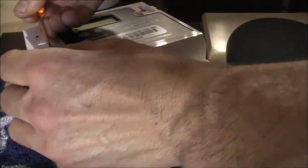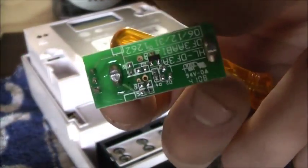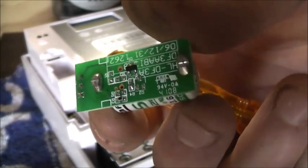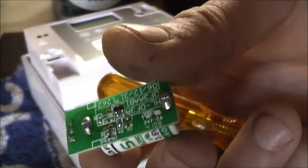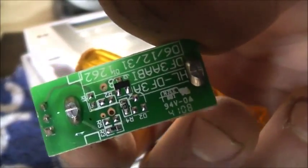Okay, here's a battery — got to put this clip up. The whole thing has gone apart now. Fiddly. And there's a battery dated the 8th of the 12th of 2006, and this little circuit board — it has protection circuitry, and the MOSFET for charging. 41st week of 2008 — you can see in the bottom there: 4108.